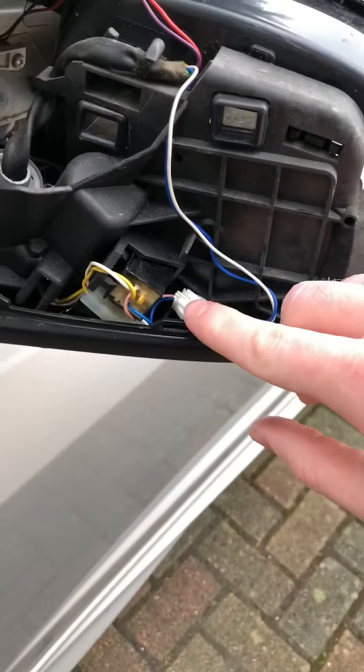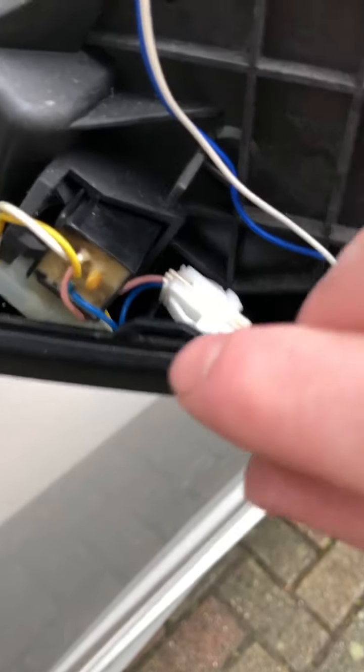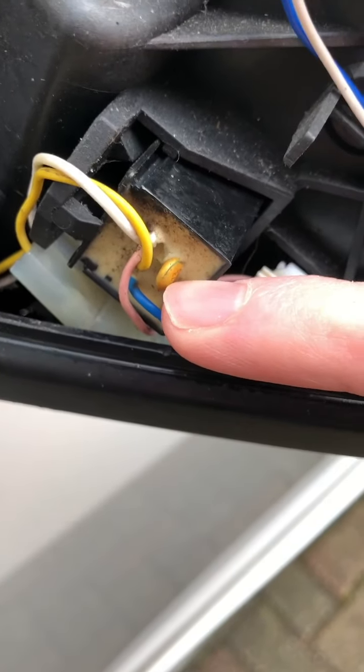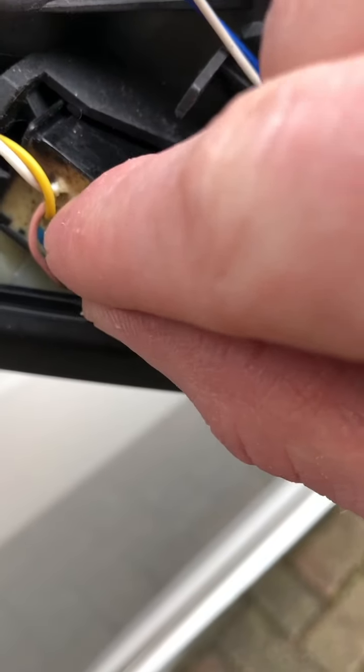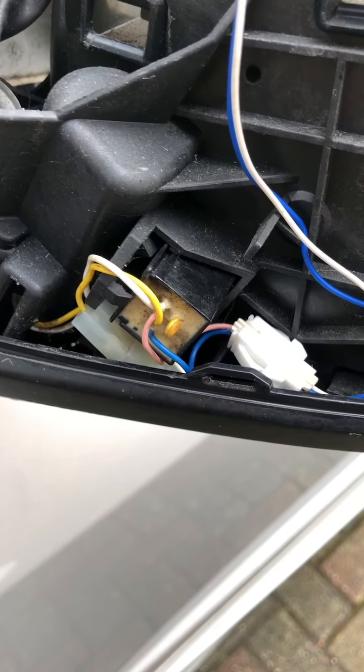This is the device here that you want to replace. We can tell this is what's broken — the actual resistor casing has overheated and cracked. So we'll release that and be back in a couple of seconds.